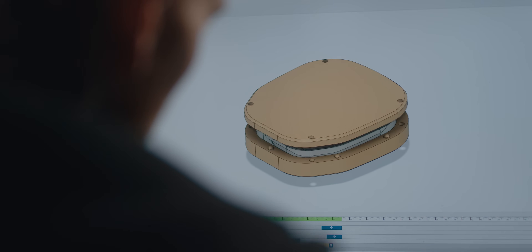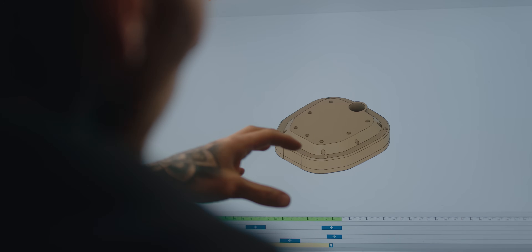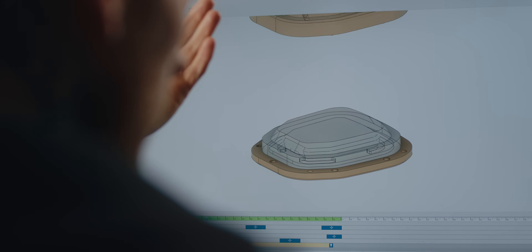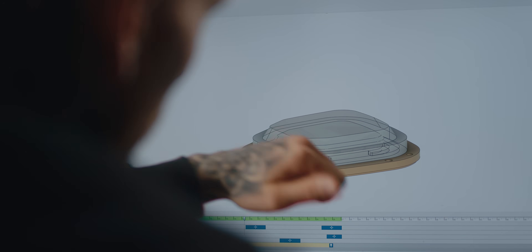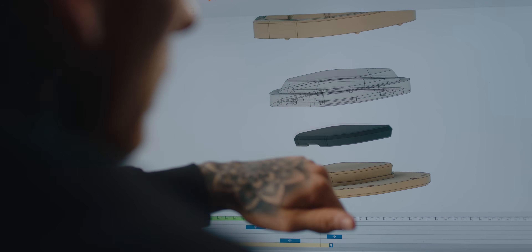The only issue with this is that it's going to leave evidence on the front of the part that there was a split line in the mould. No matter how well those two halves meet, you'll always get a flash line at the join. With this being a flexible polyurethane, I can't sand this down and prep it like I would a rigid part. So I need to make sure this comes out of the mould as a finished product. The way I'm going to tackle this is to have the two rigid sides still, but also have a silicon insert. Because that's in there, I can redesign the internals of the back piece so it comes off easily. With the silicon being flexible, I can just peel that off as well, eliminating the undercut problem, and then peel the flexible pad off too.